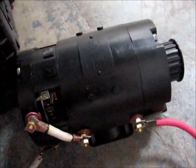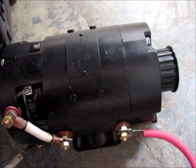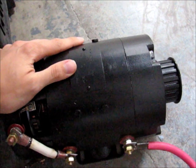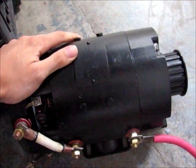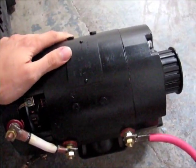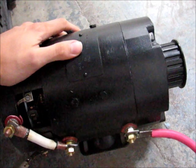This is the motor — the drive motor I plan on using in the actual go-kart. It's a 24 volt rated, apparently one horsepower. That's pretty sad, but I've heard you can overvolt motors like this up to double their voltage nameplate rating, so I'll be switching that out to 48 volts. Based on my math I should be able to get 10 horsepower from it, just very instantaneously — just enough to rip those tires off.